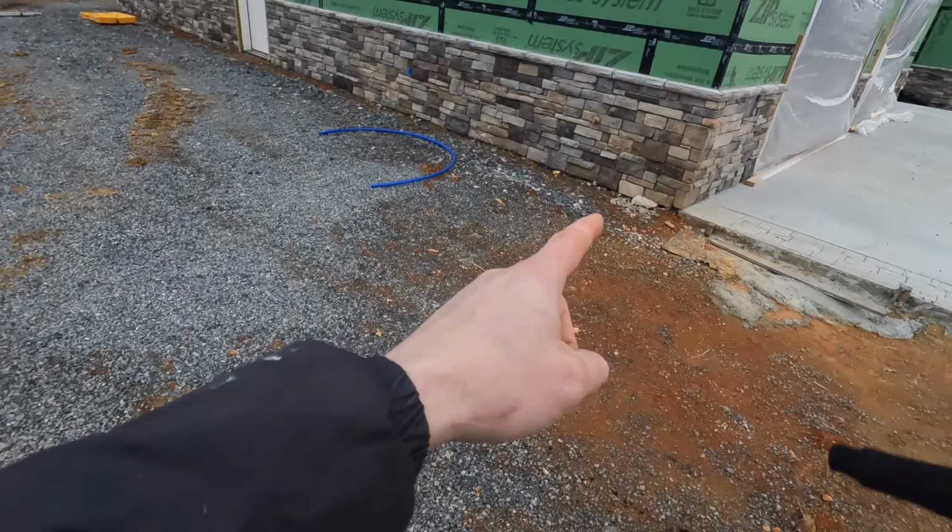I'm going to put a 1-foot overhang on this shed on the sides and then the front. I've got a 2-foot on the house, but I didn't want a 2-foot overhang. So I want to keep as much room coming in the front of this, or the back side of this shed, as I can for my post spacing. So I'm going to put a 12-inch overhang on it. I just think buildings with overhangs look better. So it's the reason I'm doing it. It'll be more trim work, more soffit work, but I think it'll look better in the end.